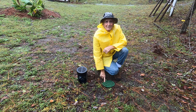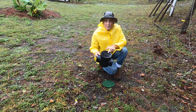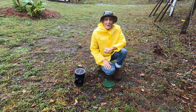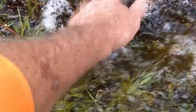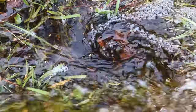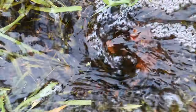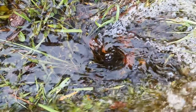Can you see this catch basin right here? It's the same one with a green grate. Let me show you what happened during an event rainfall where we get two or three inches of rain in an hour. During a huge rainfall, you can see how well the catch basin works. Look at that vortex — this is pulling all of the water from this area directly into the pipe. There is a French drain attached to this, but look at the surface water being carried away.